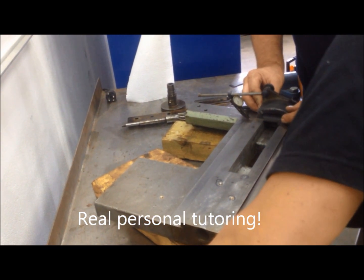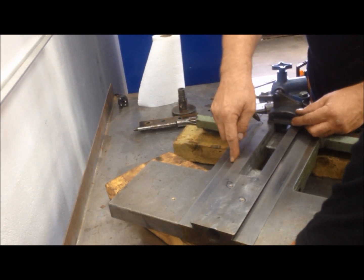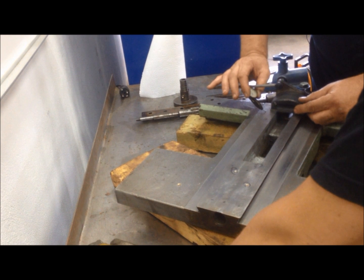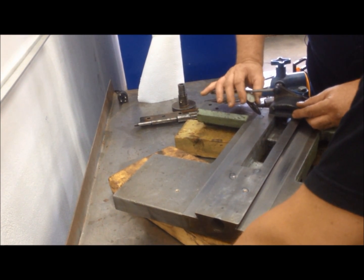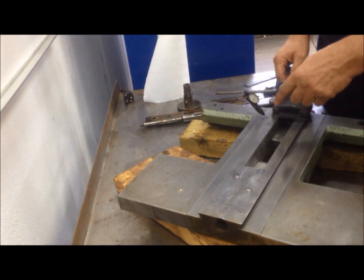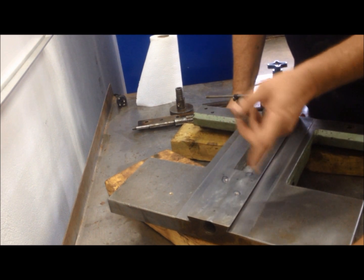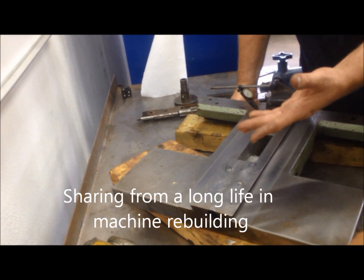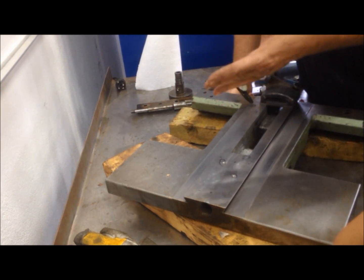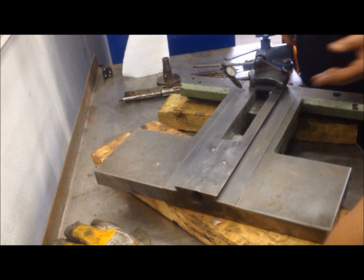It's straight, but it's lower, because this is the side the dirt comes in. Yeah. So usually you make this zero. So we'd make this zero. And then, instead of going minus, you make it zero, so where it's plus, that's where you scrape. Otherwise you think, oh, this is minus, and then you scrape it where it's plus and it makes it worse. But that's how I do that.